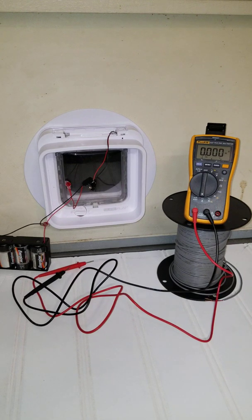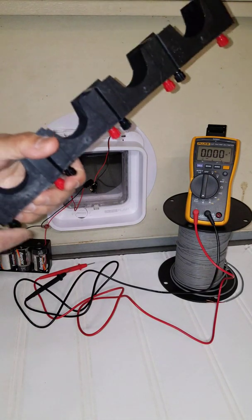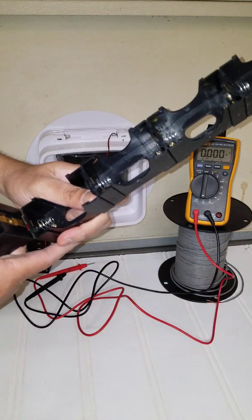They say that you can't use rechargeable batteries, but I believe that you probably can — you just need more rechargeable batteries. Typical rechargeable batteries, the old nickel cadmium or the current nickel metal hydride, use about 1.2 volts. You have five of those in series, and you can get systems like this modular system made for multiple D-sized batteries in series.